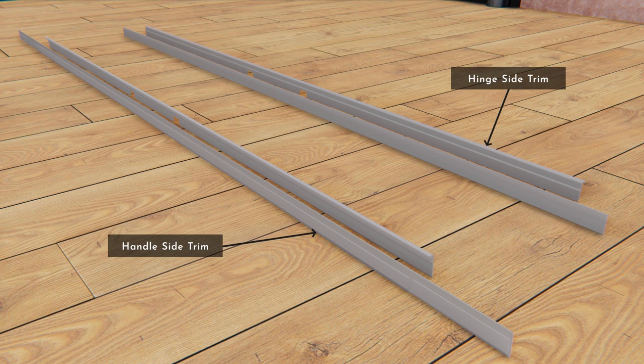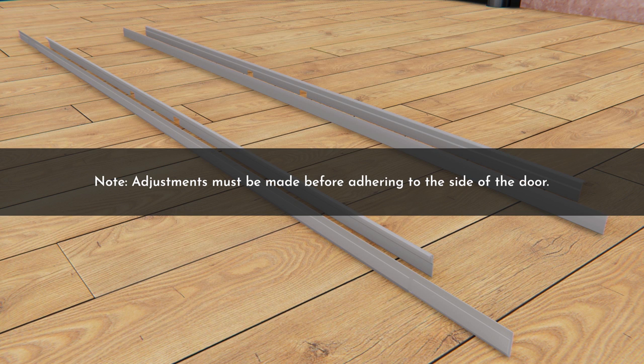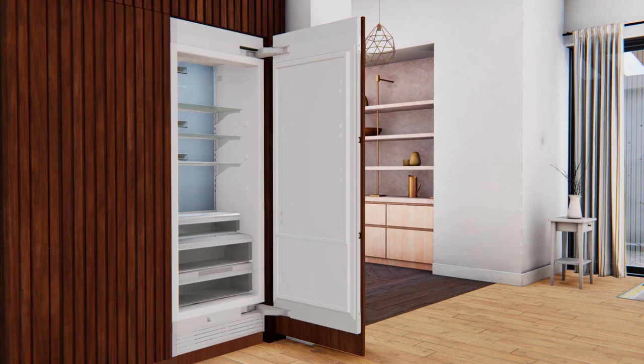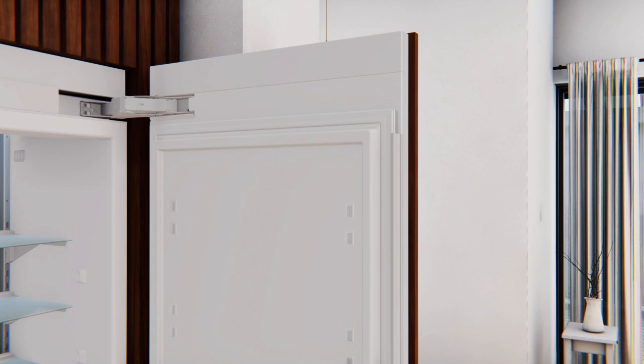There are two door trims to install on the overlay door panel — the handle side trim is a long trim and the hinge side trim is a shorter trim. The side trim consists of an outer trim and an inner trim. Inner and outer trims should be adjusted vertically to align with the top and bottom hinge covers during test fit — adjustments must be made before adhering to the side of the door. These trims slide in and out to hide the gap between the product door and the overlay door. To install the handle side trim, clean all sides along with the top and bottom hinge covers using rubbing alcohol. Test the fit of the handle trim without removing the tape backing, place the outer trim top on the hinge cover, align the inner trim between the hinge covers, place the outer trim evenly against the back of the door panel, and push the inner trim to contact the product door.